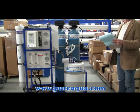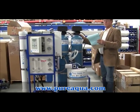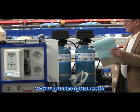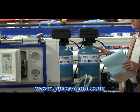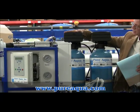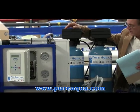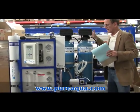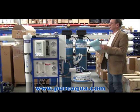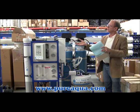On the plumbing specifically, you'll have a raw water inlet right here at the first valve. And then you're going to have four outlets — three to the drain. You'll need a drain for the backwash on the multimedia filter, a drain line for the backwash on the activated carbon filter, a drain line for the RO reject, and of course you'll have the RO product exit. So four lines exit this equipment, one of which is your product water, which should go to a tank at atmosphere. Quite often, people use a level control switch with a product tank and a float to start or stop the RO system.